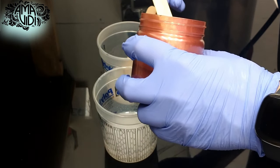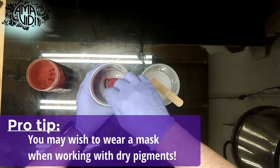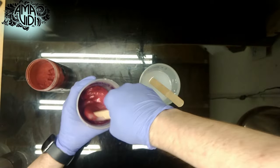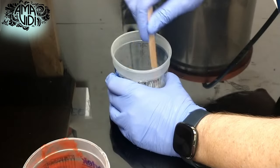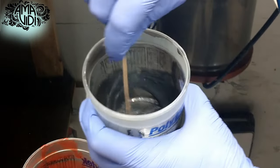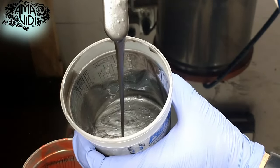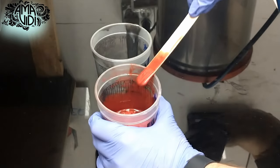And now we'll add our pigment. Roughly speaking, you'll need about one gram of pigment per hundred grams of silicone. However, that can be adjusted up or down, depending on the color or just whatever you're trying to achieve. Right now I'm checking for clumps or other issues — all I see are bubbles without any clumps, so we're good to move on.